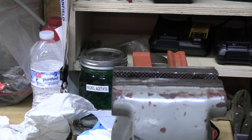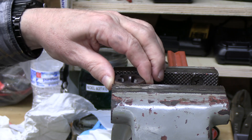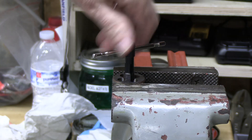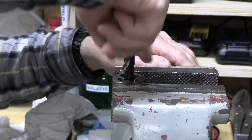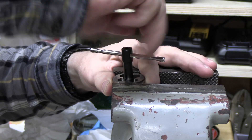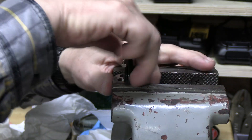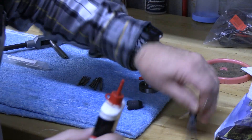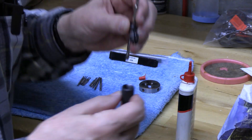The threads inside are nice and shiny now — they've all been cut. We'll put the die in the vise and run the tap handle through it. This is just thread chasing basically, and this one was pretty good so it didn't have to do very much. We'll wipe both pieces off and put just the smallest amount of oil on the nose cone.